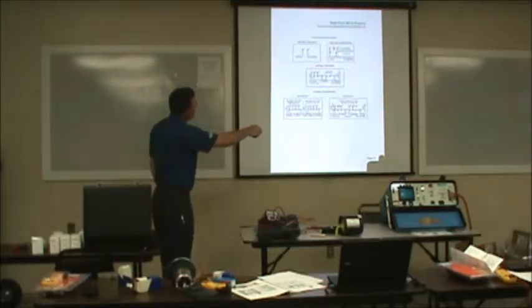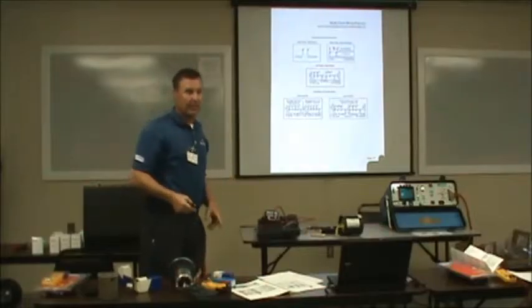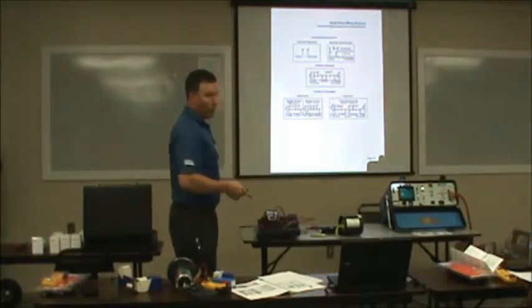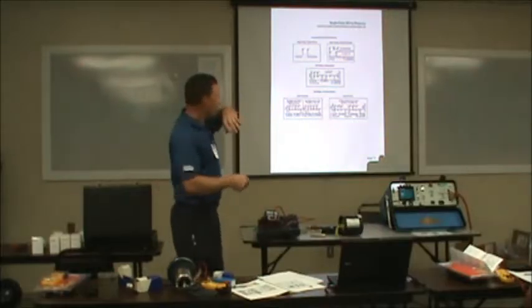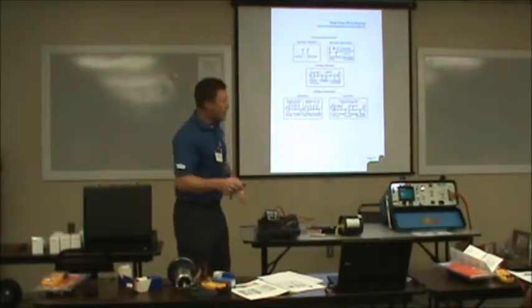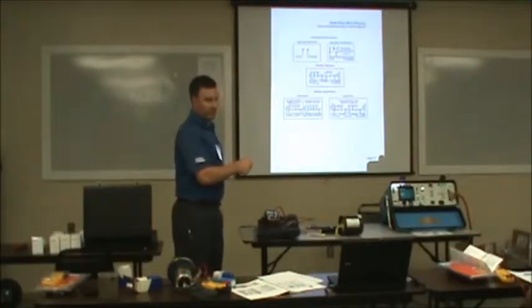You got L1 and L2. That's line 1 and line 2. On single phase, you've got two lines. Three phase, you've got three lines, L1, 2, and 3. Anyways, L1 and 2, you see L2's just got one wire going to it. And you would be surprised at the people that'll try to put a line up here to where it don't go.